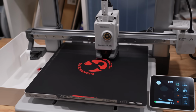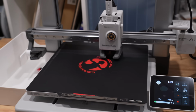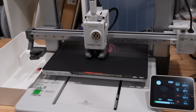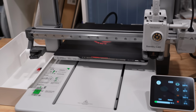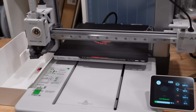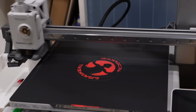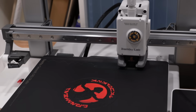These were not settings that I messed with at all. I wanted to see how it would run with the standard Bambu Studio slicer settings, whatever the defaults were, because I figured that's what all beginners would use. They would not start messing with this. So it is pretty universally considered a bit overkill in terms of waste. It's really not necessary to be purging as much filament as it automatically does, or creating as large of a purge tower to still get the same flawless prints that this machine will do.